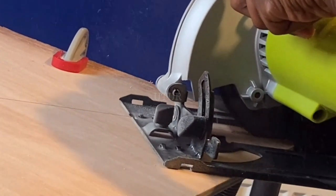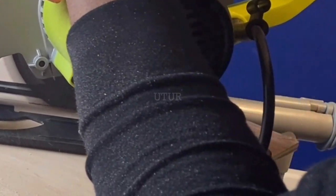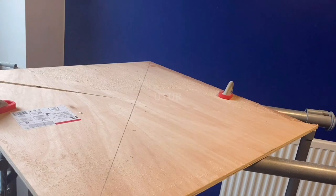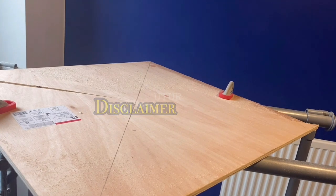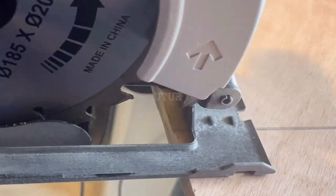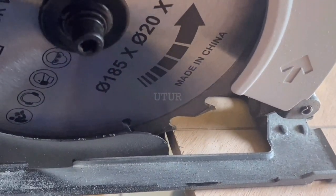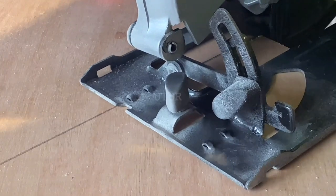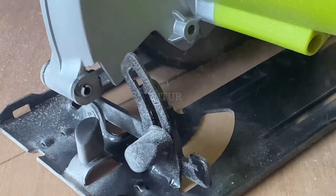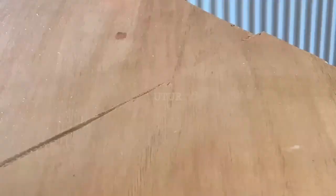I have deployed the use of a rack to make diagonal cuts. You don't have to do this — you can use a table saw. If you haven't got a table saw and your workbench is an impediment to making diagonal cuts, then you might give this a go. Make sure your G-clamps are adequately secured to the hardwood plywood board, you're not pressing your weight on the saw, and that there isn't any movement in your rack when using the circular saw to make diagonal cuts.